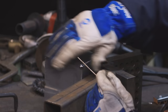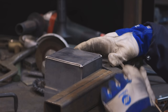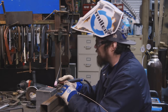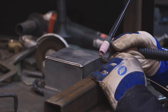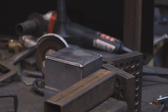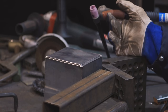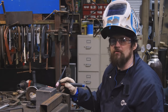First I'm going to weld around the bottom seam all the way around. I tacked it in the corners — I like doing that just to help keep things square. A lot of times you'll hear people say don't start or stop a weld in a corner. What I'm going to do is wrap around and do a short little weld like that, so my stop and starts go over the tack and my stop is right here — that helps minimize leak possibilities. I'm super shaky, so that's why I have this steel stacked up here as a hand rest. I just use whatever I have laying around — it helps with my stability and the stability of the arc.